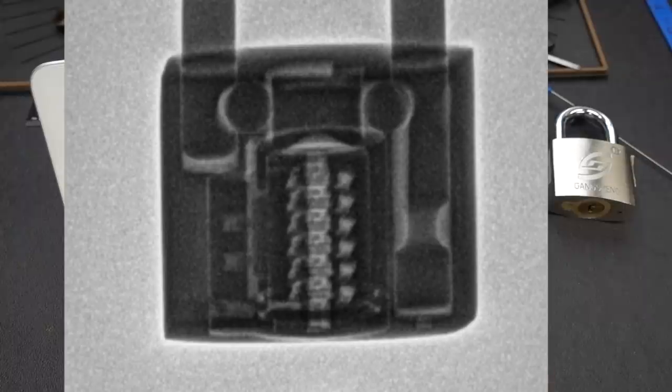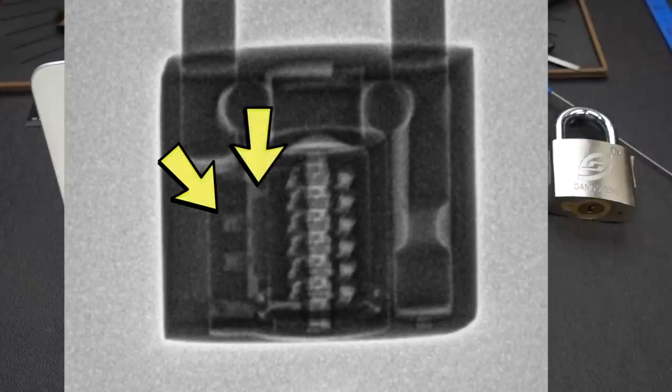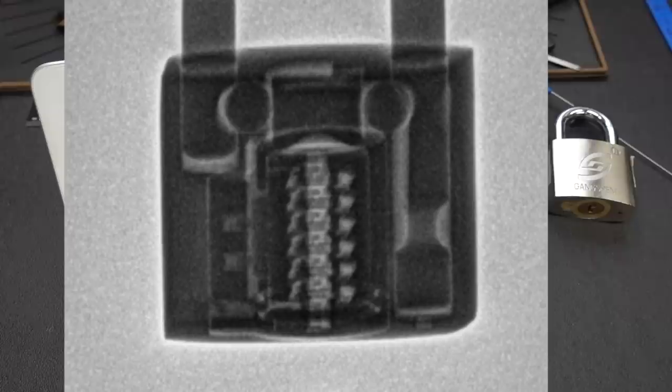On the left, and this is where it starts getting really interesting, you can see two small washed out areas and what appear to be ball bearings sticking out. And those two ball bearings are resting or being pushed up against what I'm going to call the sidebar in the lock. There's a cutout in the core, you can see it very clearly, and that sidebar is sticking out, pushing against those two ball bearings. So that explains why we are able to rotate this core. There's an air gap between the locking mechanism and the ball bearings and this core. This very, very cool design.